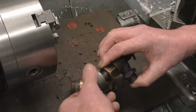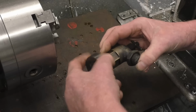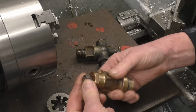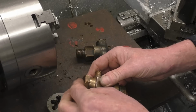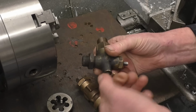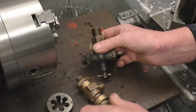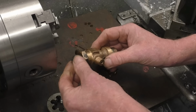half inch BSP, so it's going to make it quite a simple job just to put a die down there once I get it machined down. Also on the end of here, it's got this nut welded on. It's been nicely made, but that's absolutely horrible. So I'll modify that as well, take that nut off and make something similar to that, which is much more pleasant. So we'll machine this down to size, put some threads on there, and then see what I can do